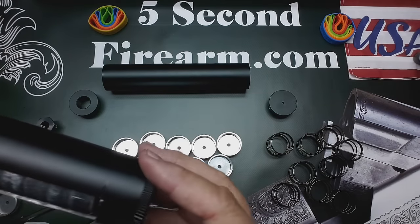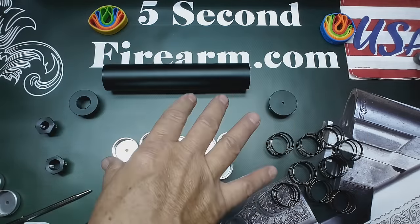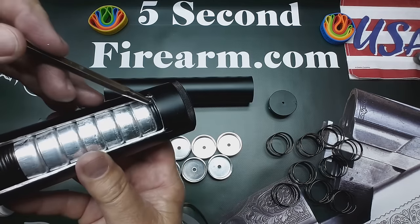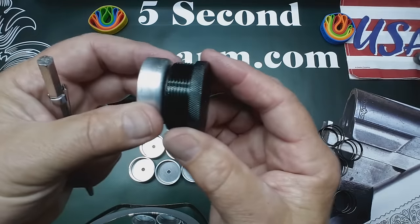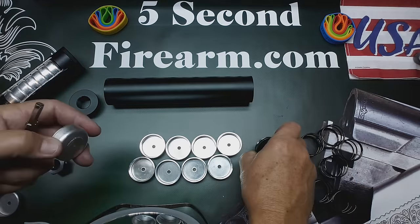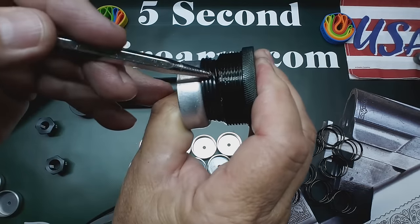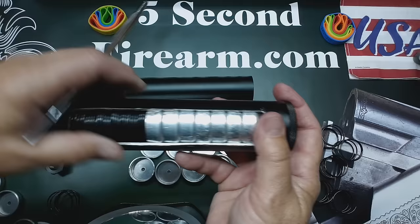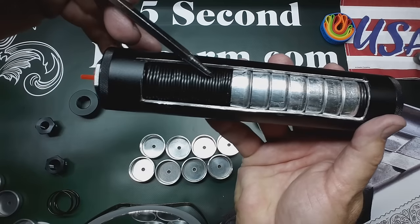Let's take a look at your stacking order. I have a 7-inch cutaway tube here so it only has 7 cups, but this kit will have 9 cups. Your stacking order is: on the very end you want one spring first at the bottom. Normally you would have a cup flat against an end cap and those two would operate together giving you less filtration. So what we have you do is put one spring down the tube, compress that spring, and that gives you some air space for filtration of that last cup. You begin with the one spring, then your stack of cups, and then the remainder of the springs.